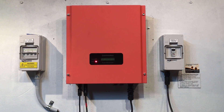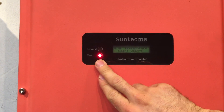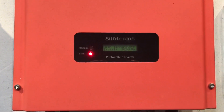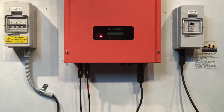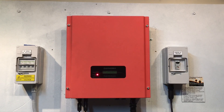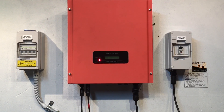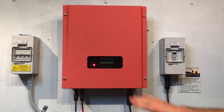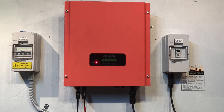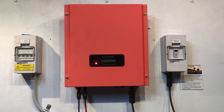Here we have a KLNE Sunteams photovoltaic or solar inverter. You can see on the screen the red fault light is lit and it's coming up with 'high temperature'. Now the Sunteams inverter could come up with this fault if installed outside in full sun on a very hot day, but in this case it's not a hot day, the system's not producing much power, and it's installed in the shade — yet we're still getting the high temperature fault. So it looks like it's most likely an internal issue with the temperature sensor inside the inverter, that the sensor has failed and is giving an incorrect reading.